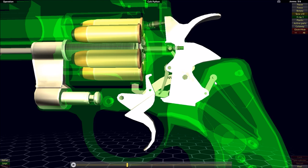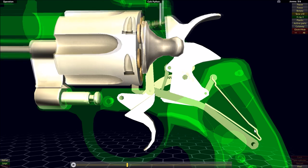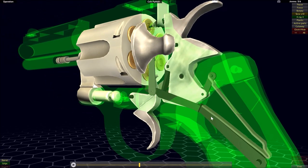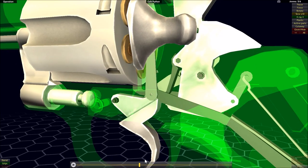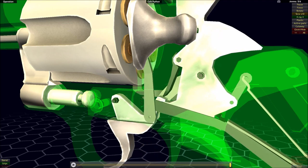The hammer is driven by its mainspring, which is a folded flat spring. After driving the hammer forward and down onto the firing pin, the mainspring has not actually finished releasing its tension. It continues to release its tension downward through the other side of the flat spring onto a bar, and this bar interacts directly with the trigger.